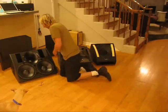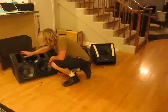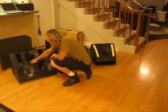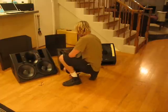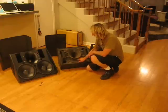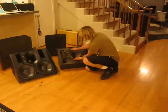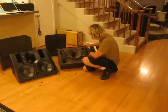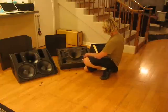On the DMB you can see we've got double 12s with ports up here next to the compression driver — looks like a 1.4 to 1.5 inch compression driver — and an oval horn. On the Allacoustics we've got a single 15 with a concentrically mounted horn giving the coax some more dispersion control, and three ports around the outside.